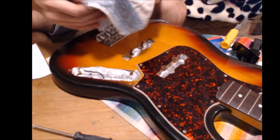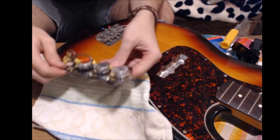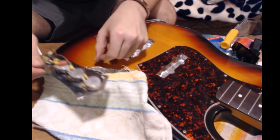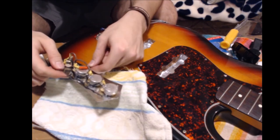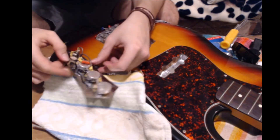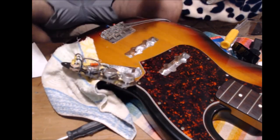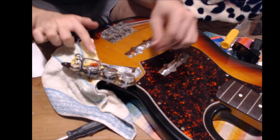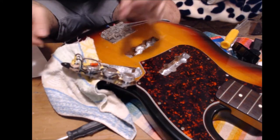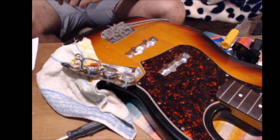So, that first step will require attaching this to ground. The ground typically goes right there on the tone pot. So we have a nice space already here where we can just solder this lead onto. You can't see, but I've got that ground lead attached around the leg of the capacitor that's on the tone pot that I left loose there, so that should be a good place to ground this thing.